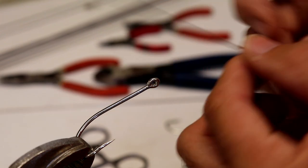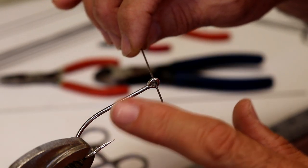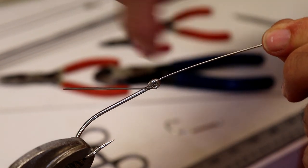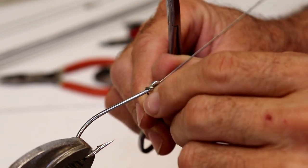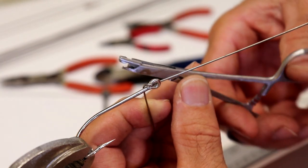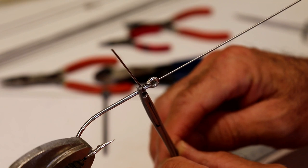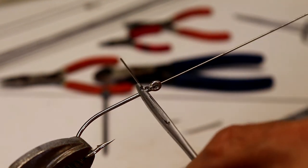This is kind of a middle-of-the-road wire — it's the wire I use to make the spinner baits. You come in from the side of the eye away from the hook point and give yourself about an inch and a half, then rotate it. You have the standing part of the wire pointing straight back, you end up with a little S-turn, and then you bring this around so the tail end is perpendicular to everything else. There's a gap in the tool here for the hook shank, and a slot for the actual wire — that little slot holds the wire as you rotate. Angled, it gives a loose helical winding; kept perpendicular, it gives a nice tight winding.